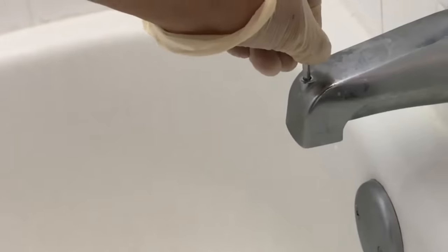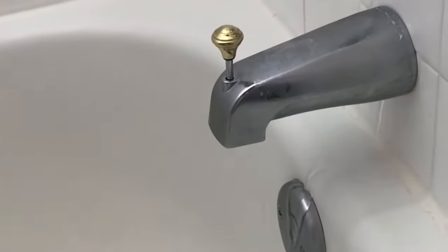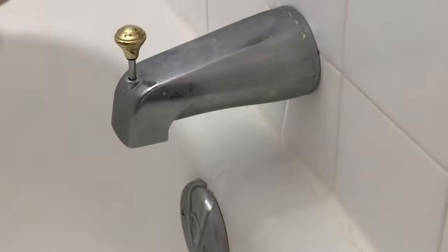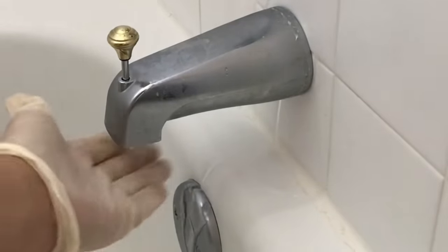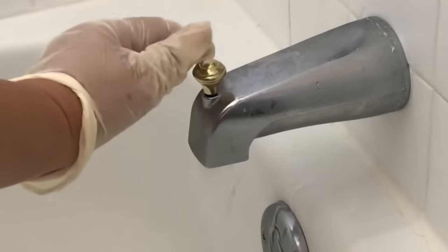The diverter is fixed and for the vast majority of you, I've covered all you need to know. But this video continues because I'm now going to show you a problem that I encountered that a few of you might also experience, and it's that the water is leaking from the other end of the spout. I was afraid something like this might happen when I saw Teflon tape on the copper pipe after I took the spout off. This leak is a sign that the o-ring inside has gone bad and needs to be replaced, and in the remainder of this video I'll show you how to do that.